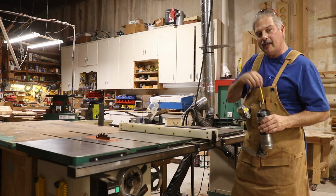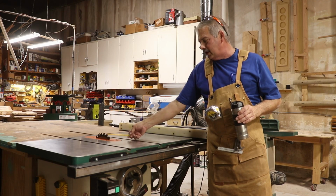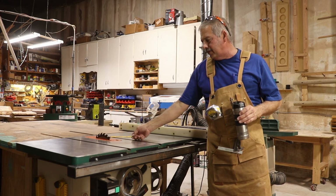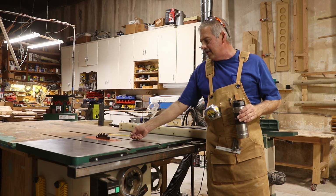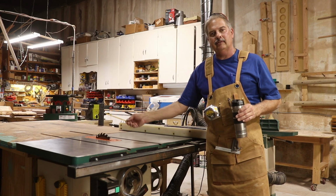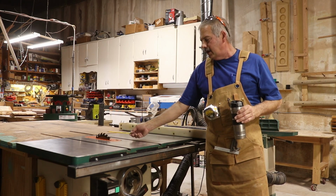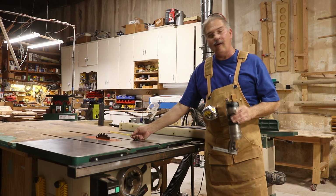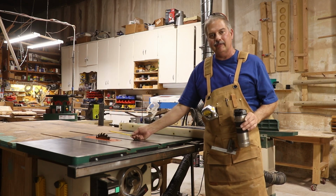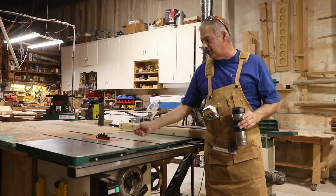This particular blade is a little bit different than you'll buy at a hardware store. I spend as much as 150, 160 bucks on combination blades trying to be able to cut rip cuts and cross cuts with the same blade, just like they try to sell you. It also thin kerfs, right? It's going to save wood. Well, all that works against what we're trying to do here. To get a glue up quality cut, we got to go specific.